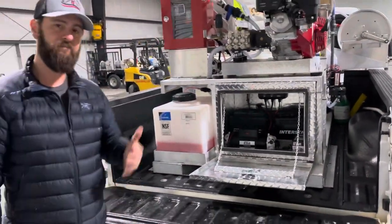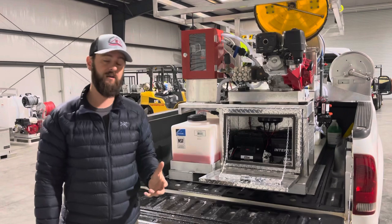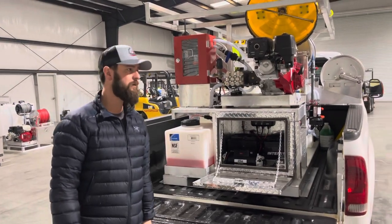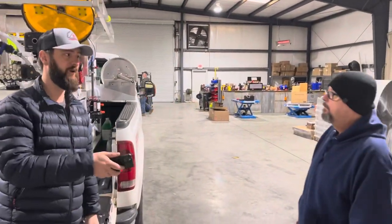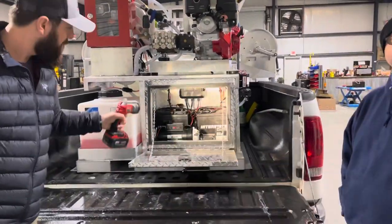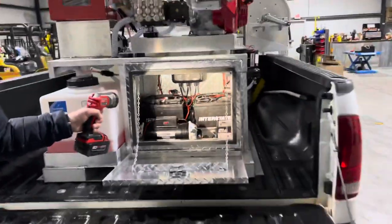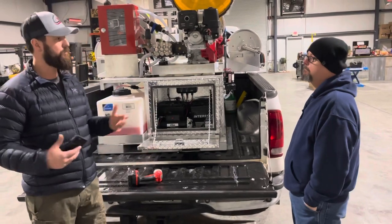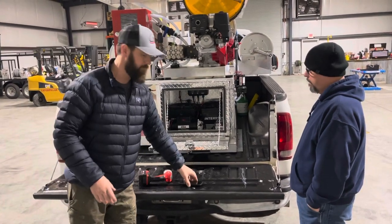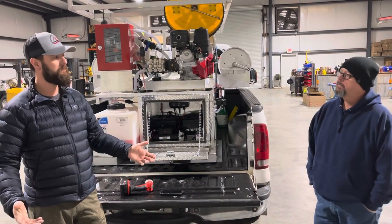Maintenance Monday — hope that makes sense. If you're building your own systems and going to run 24-volt systems, our Smart Blend Pro is a 24-volt system. We've got a transformer on that so you can hook it to 12 volts and the transformer will get it up to 24. I think we covered the bases. Make sure you make good connections, short runs, and don't use little bitty wire — use as thick as you can get it. You can go to Tractor Supply and they've got little jumper leads pre-made; those are actually the best because they're crimped on at the factory and have a good connection. See you all next Monday.